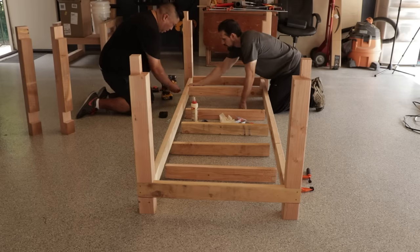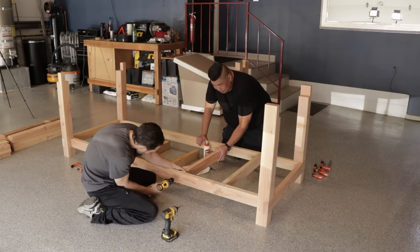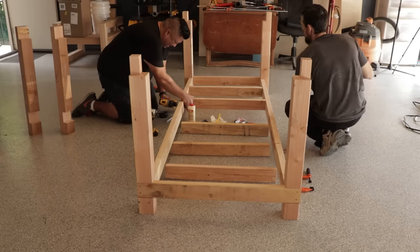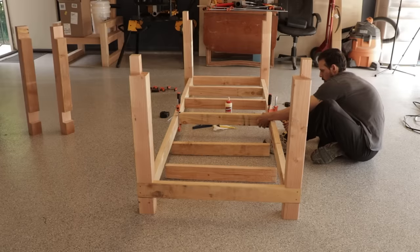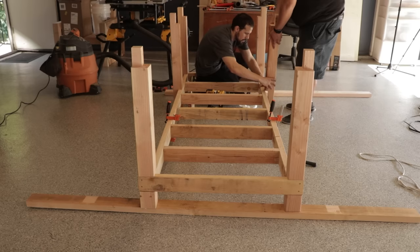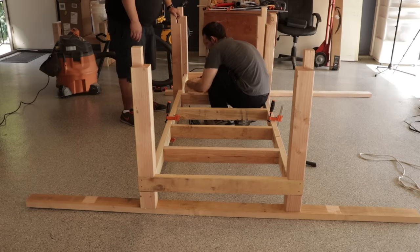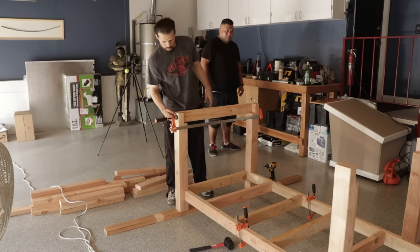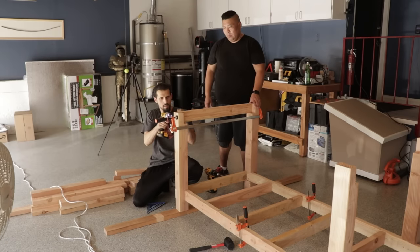So here I did make a bit of a mistake. My plan was just to screw the plywood straight into the 2x4s, but once I saw it sitting on there it looked a little too nice so I decided to use pocket holes to keep it in place — which would have been really nice if I'd done them before screwing everything in. These legs mark the back end of where the table saw is going to sit inside the workbench. That finishes up the bottom of the frame, so now we're moving on to the top frame. Always check to make sure everything is square.